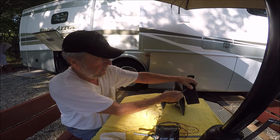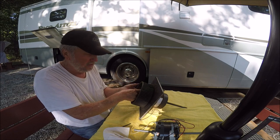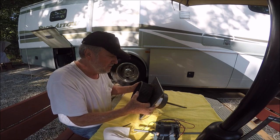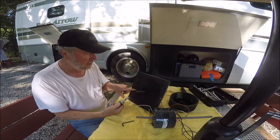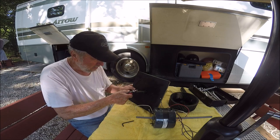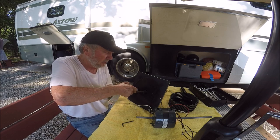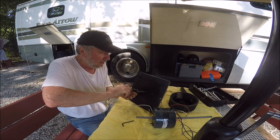I don't have a long Allen so I'm doing it the old-fashioned way. Once you've gotten the screw completely loose, a little rocking and pulling and it comes off very easily. Before you do that, look at the distance it was positioned at. A 9mm socket works great. Just get a little bit of the insulation out of there as you put your tool in, then loosen it up and take it all the way off — all four of these.